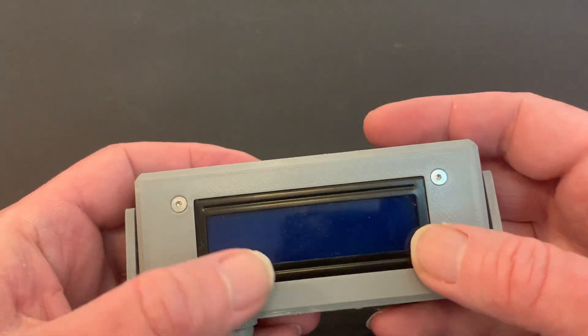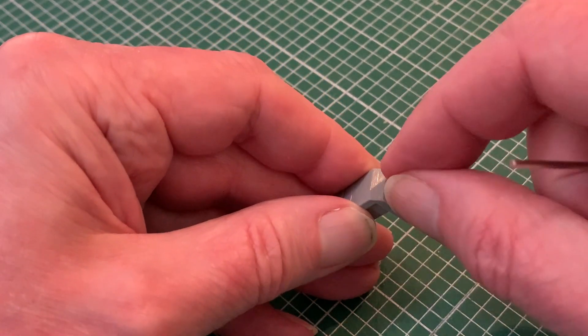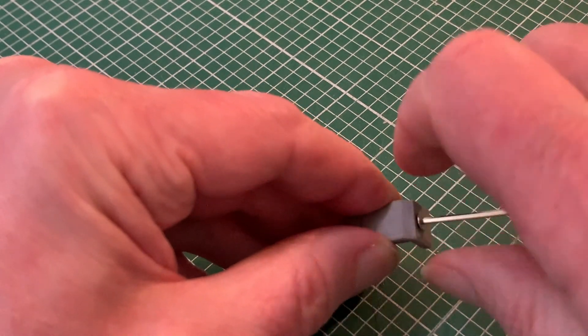This is the method I came up with: to pop the nuts in mid-print so the nut is entirely enclosed in one half of the case, ready for the bolt from the other half to tighten the two parts together, leaving just the head of the bolt showing.